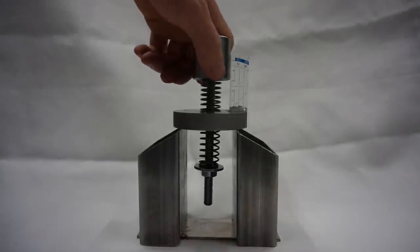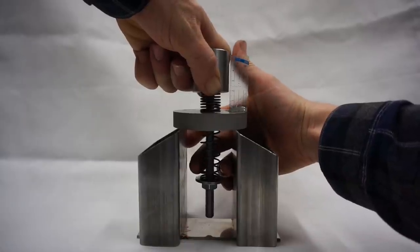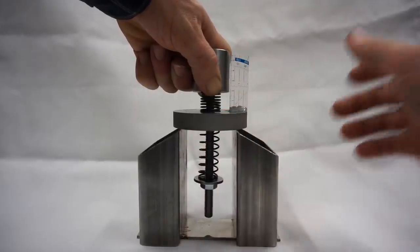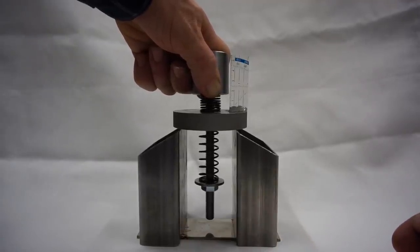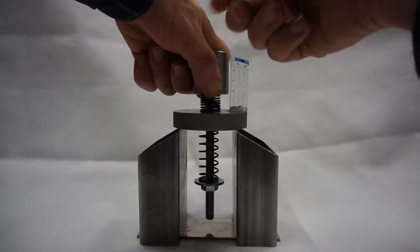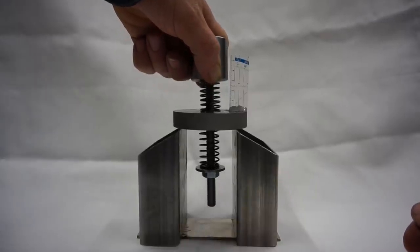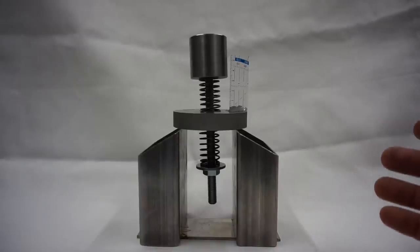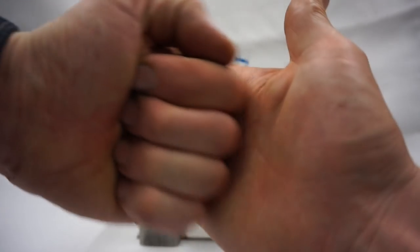Now, consider this extreme case here. The spindle load is so high that the preload almost vanishes. This is roughly here. This constitutes the design case according to which we set the preload. In other words, we determine the spindle's preload from this maximum external load. This is done because the designer wants to keep the bearing rollers or balls in permanent contact with the track. Not only does this give high rigidity and robustness for the spindle, because all rollers are in contact regardless of their tolerances, this can also increase bearing life because abrasive sliding of the rollers on the tracks as they start contact again is prevented.